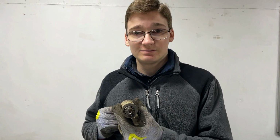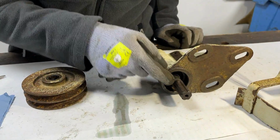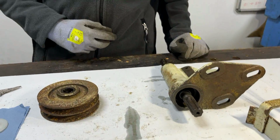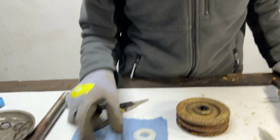Slight change of plans now. Instead of putting the oil seal on next, we're going to put the big bearing on the other end of the PTO in there. Idea being, at the moment, it does move around a tiny bit, and we don't want to risk damaging the oil seal, which could possibly happen if that moves about a bit when we're fixing the big bearing in.